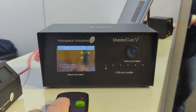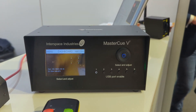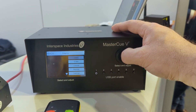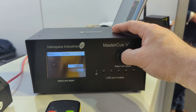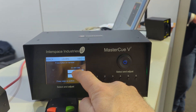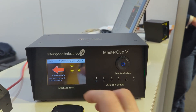It has a handset here, but it's not been programmed. To program a handset as you would normally, you can hit the send button, it comes up with a learn option. You learn the handset and then push the button you want to save. It comes up — and this is a touch screen — so you hit the save button there, and now if you push the button we've got a command going on it.